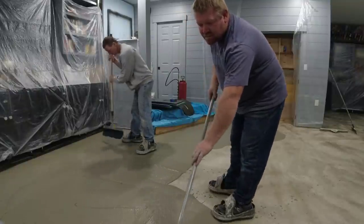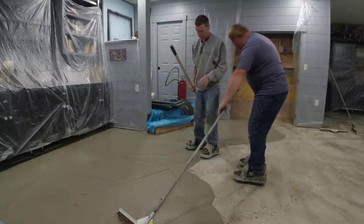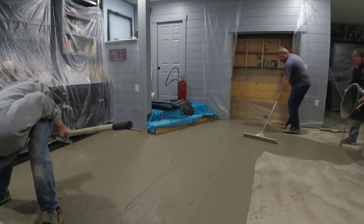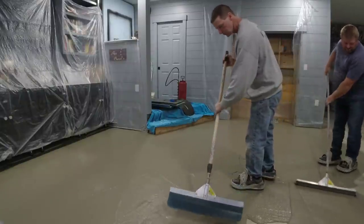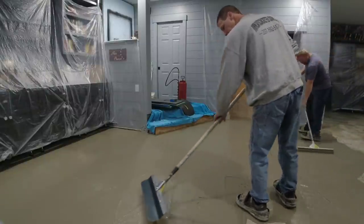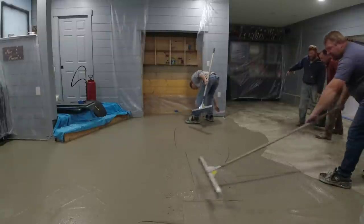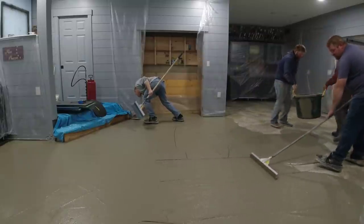You can see how good that stuff lays out - really really nice. The key is just keep moving. The smoother gets it pretty smooth; I don't have to be crazy fussy. I just need to get the lines and grooves out left behind by the gauge rake, then just leave it because you're going to stamp it and put texture on it anyway. I just want to make sure it's somewhat smooth. We're both wearing spike shoes because you've got to walk in this stuff - some golf shoes or baseball cleats work. You can see I'm leaving some lines behind but they're fairly smooth and you'll stamp those right out.